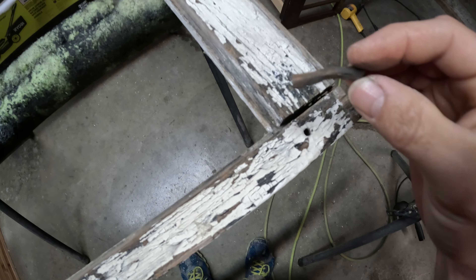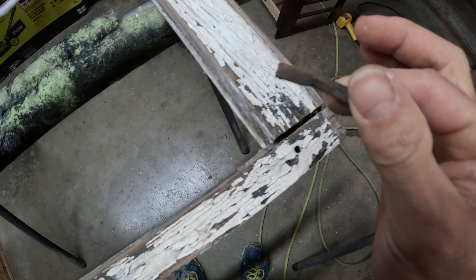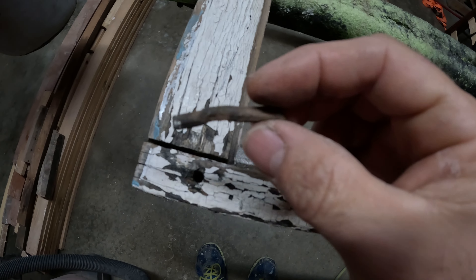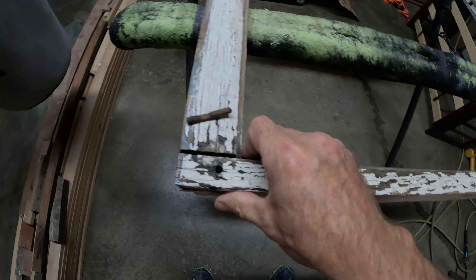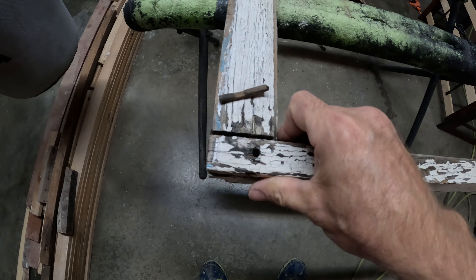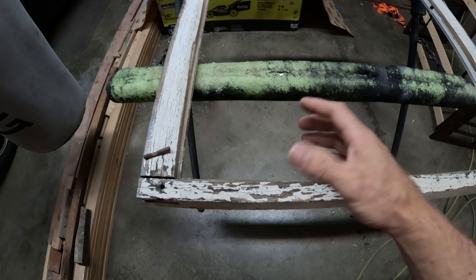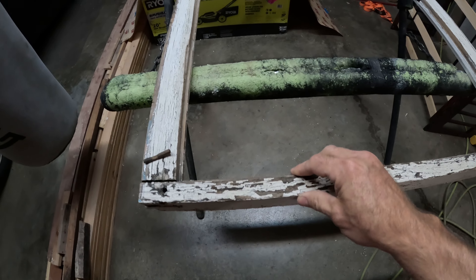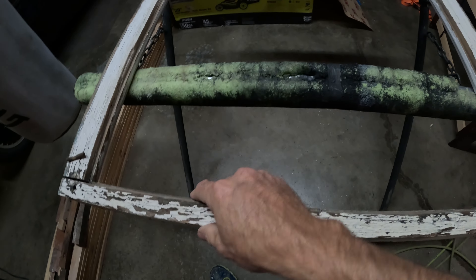This thing's going to be loose because that middle piece has shrunk down — it's no longer thick. So what you have to do is replace these wood dowels. Both sides are like that — you can see this one, how it's bent in the middle. It was moving back and forth, really loose, and you don't want that because when you open and close your window you're going to have a really loose window at the bottom.